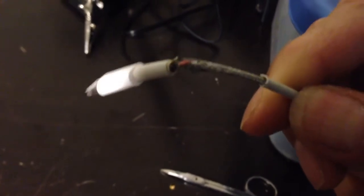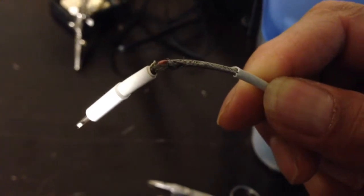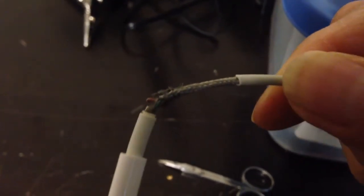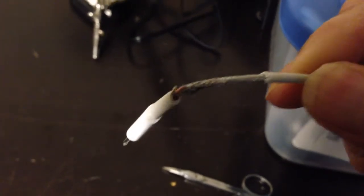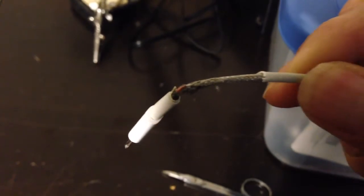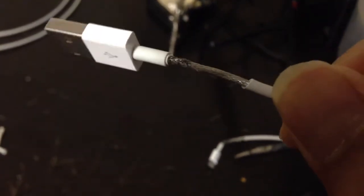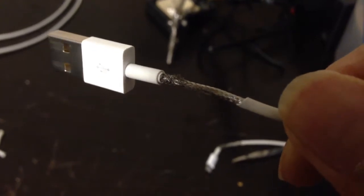That red wire has completely broken. And the outer metal wire that encircles the inner wires has also completely failed and just separated. I found that when I was pushing it together, it was connecting intermittently and then disconnecting again. The other point where you can get failure is where it's plugged into the wall, but that seems to be less of an issue. You can see some fissuring of the outer cables, the outer layer, but the inner wires are still intact.